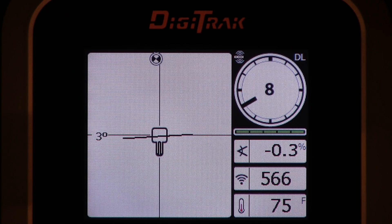The last thing I'll tell you about calibration: I like to verify my calibration. After I calibrate at my prescribed 120 inches or 3 meters, I'll move it in or out to another distance and just make sure the depth reading is correct. I'll move it in to 5 feet — what does it say? 5 feet. I'll move it out to 4 and a half meters — what does it say? 4 and a half meters. We calibrate it, then we double-check that calibration.